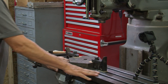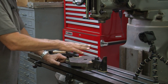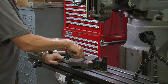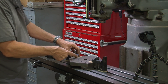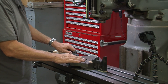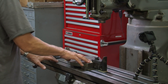Remember this table is our index surface. Another big rule about using step clamps like this: always use at least two clamps. If you try to use one clamp and cut out here with just one clamp, the work piece will rotate. The truth is it really only makes contact in one place — it's pushing down but it's not holding it side to side or keeping it from rotating all that well. So that's one of the things to be careful with when using step clamps.